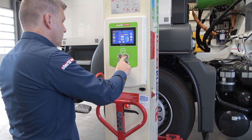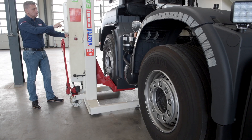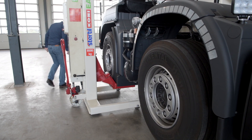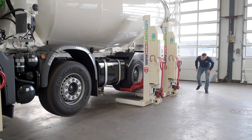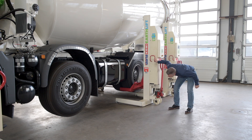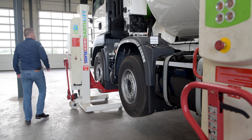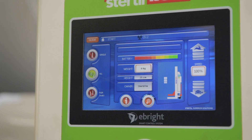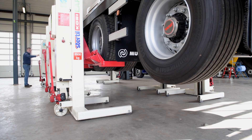It is important to make sure that the indicator lamp is lit up for all operation. At a height of approximately 12 inches or 30 centimeters above the floor, it is required that the operator stops lifting by releasing the button and does a visual inspection. Walk around the perimeter of the vehicle to ensure that the lifting situation is stable and safe. All of the columns in the set will raise as long as the up button is kept pressed. All columns are fitted with a height measuring device and the group will lift until the maximum height is reached. It is possible at any height to lower the vehicle into the mechanical locks.